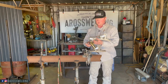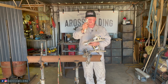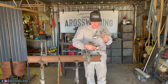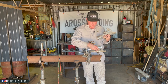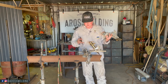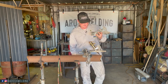Another hack or trick I learned while pipelining: this tool here is half of an original wedge — cut in half long ways and notched here and here. It's useful as a wrench for a bevel machine if you're doing a lot of fab work, versus using pliers on these wing nuts. If you buy one brand new, technically you shouldn't have to use a wrench because these are made to be hand-tightened. But once you start using a wrench, sometimes the threads get stretched out and it won't get tight enough without one, so if you buy one used this is a handy tool. Not only is it a wrench, but you can also use it as a spacing tool to fit your pipe.